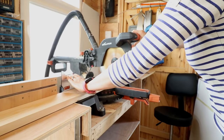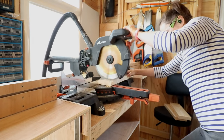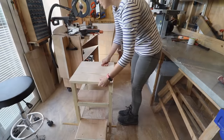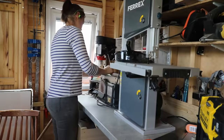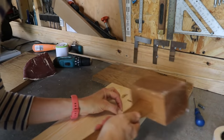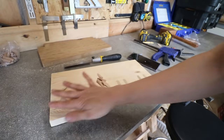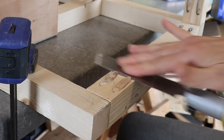For the top piece — which would be my seat — that definitely needed to be split in half. I was going to use some 20mm thick wood, but instead I acquired some planks. I went for pocket holes that wouldn't be seen, or so I thought. I found some 10mm dowels that were just a little bit too big and decided to hand sand them down, which was tedious but quicker than waiting for a delivery. After fixing with glue and coming back the next day, I used my flush trim tool and was left with the perfect finish — just on the ones you'd immediately see.